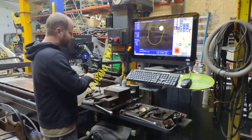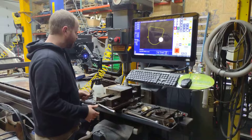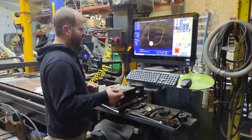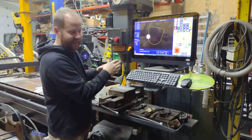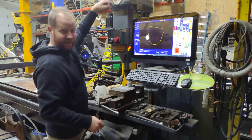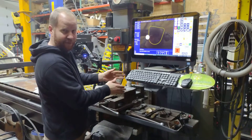Right off the bat, I can tell that my spindle speed is not correct. It was programmed at, I think, 1,000 RPM. Well, I'm running at 2,292 RPM and I think I'm just barely turning at 1,000. I'll have to get a tachometer and check my spindle. That's something that's going to have to be adjusted to sync up with my variable frequency drive.